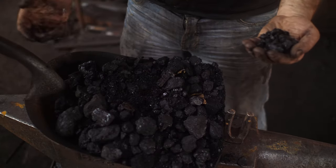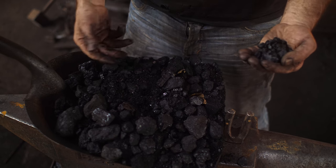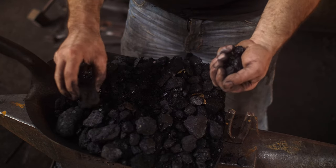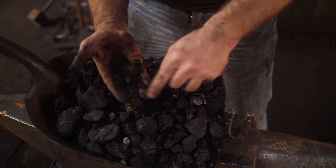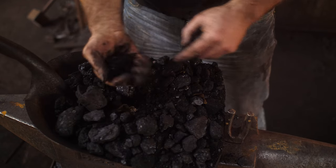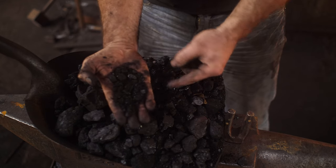This is how the coal arrives when I get it from the mine. I'm getting this coal from Northern Virginia, Southern Pennsylvania — that's geographically the best smithing coal in North America. I've been getting it there for 20 some years and using this coal for about 35 years, so this stuff works. I'll either get it in nut size or pea size — virtually the same function, not a whole lot of difference between the chunks. But in either of them there are always some fines included. Depending on how the coal is handled, depends how much fines are in the coal. The more it's handled, the more it breaks down and eventually turns into powder. That's why we don't use heavy equipment with our coal and don't move it around any more than necessary. But the fines are not really an issue, as I will demonstrate.